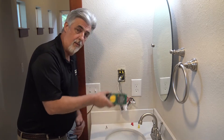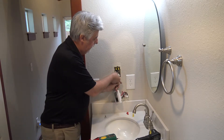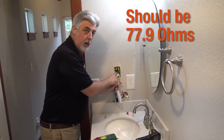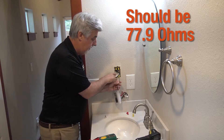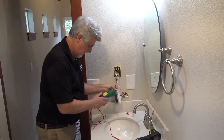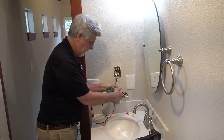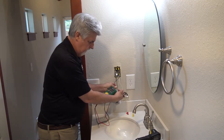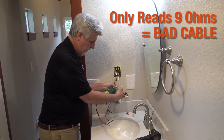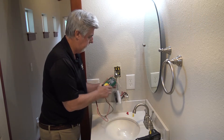To verify that, we're gonna check it with an ohm meter. On the cable it's written here what the wattage is and the voltage, and it says 77.9 ohms for this cable. We're gonna check that to see what it is. I have it set on continuity and 200 ohms, and if I go to check it, it's showing 9 ohms. On continuity it says it's got continuity, but the ohms are way off. So something's wrong.